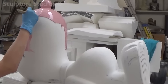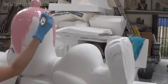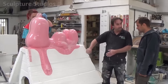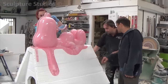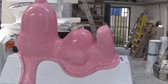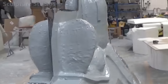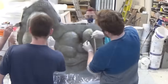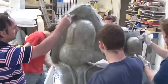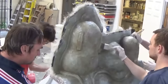With the new design now approved, we're starting to mould the Snoopy. Silicone rubber is applied in multiple layers so the mould can reach all the tighter spaces and the cast will be easy to extract. We've made sure we have the go-ahead from Robert, who has come down to the studio again to check in on progress and collect the next batch of Snoopy huts. The rubber tabs visible in the thicker wall around the edge of the mould help the rubber locate into the jacket, which is made from fibreglass to ensure the rubber retains the correct shape while being laid into. Moulds generally have a lifespan, so we need to make sure we take care of the mould so it lasts the duration of the project.